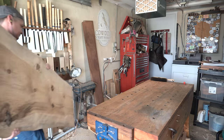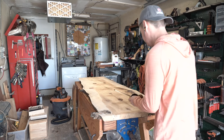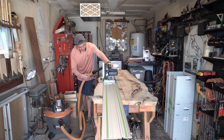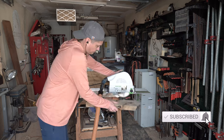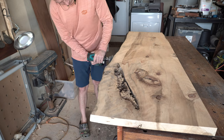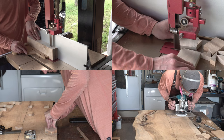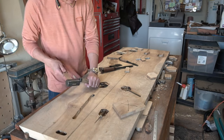The headboard is going to be a wall-mounted feature instead of attached to the bed frame itself. I'm going with this slab of Norfolk Island pine that was harvested by my buddy PJ Fletcher just a few houses down from mine. I loved the idea of having a piece of wood with a story to tell. Since this tree has about a million branches, it has a ton of knots, so I did a bunch of random geometric inlays to handle the knots, cracks, and bark inclusions — to make planing it by hand a lot less frustrating and make it more stable and resilient over time.